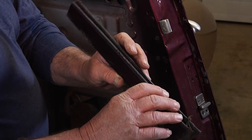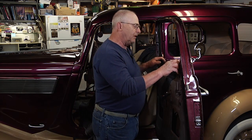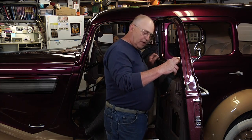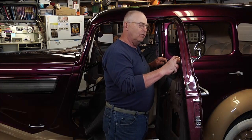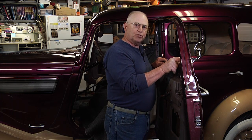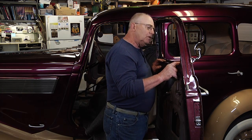We will generally refabricate this by putting new cloth on it. Next, we're going to inspect to make sure we have clear channels down in the bottom. You can do that by looking down in there with a flashlight and making sure there are no broken pieces or fabric that has rolled up. If it's in decent shape you can reuse it, but most of the time you end up replacing it.